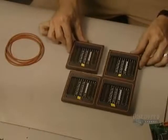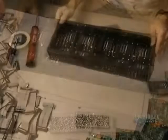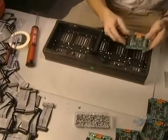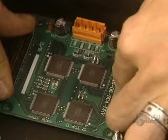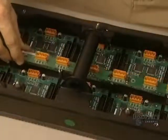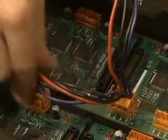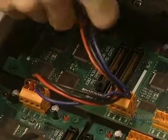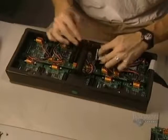The matrices are now assembled together. Then 10 matrices are joined to make up a module. At this stage, they insert the signboard conductor. Then the wires are connected. These wires transmit electric current and all the information relating to the sign. The elements require a very low voltage current, about 5 volts. Each module is then provided with its own converter to maintain a steady voltage.